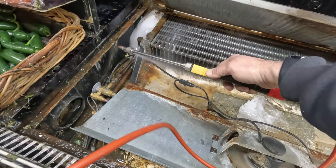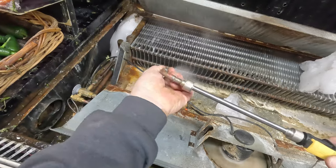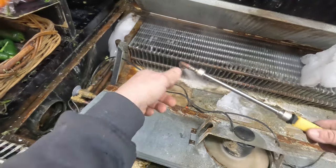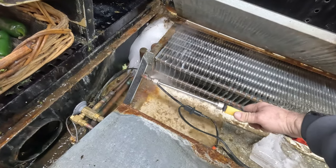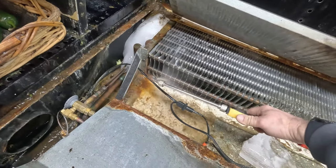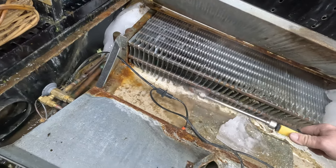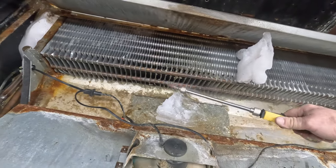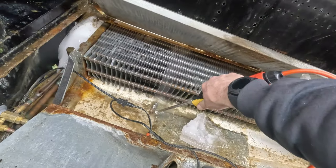Wire nutted together, which is kind of scary. If you see that sludge right there, that right there could be what's going on. The water's probably not draining. Yeah, look at that — I bet the water's not draining past that sludge. And then it's just sitting there, causing it to build up and then freeze into place. That would make sense, because that is some nasty crud in there.